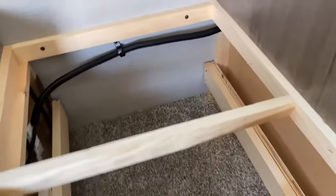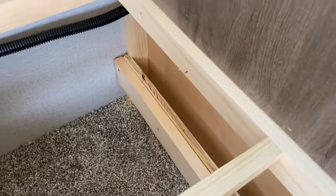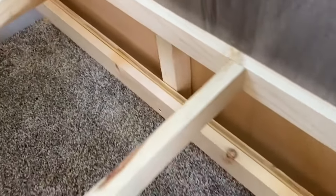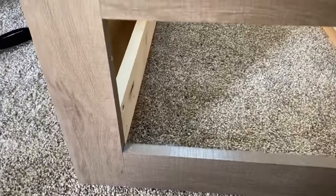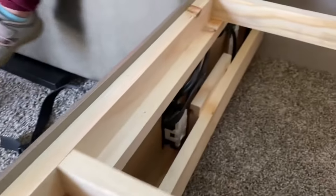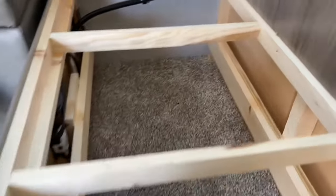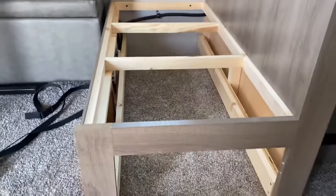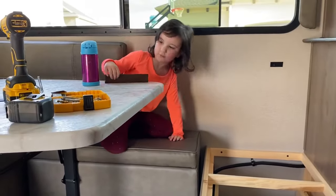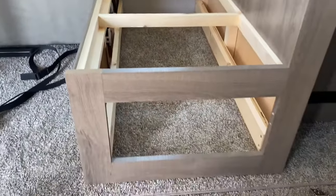This was the hardest part. Got it shimmed out. Of course it's not the same on both sides — this one worked out to be three-quarters and a half inch to stick out even. The other one was three-quarters less than a half — about a quarter inch — so I'll use composite shims to fur it out and get it right. There's that electrical I showed you. This is a two-person job, so I have someone helping: Addison. Let's get the drawer slide in.